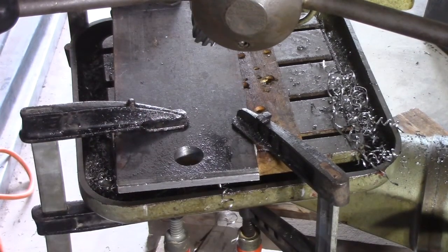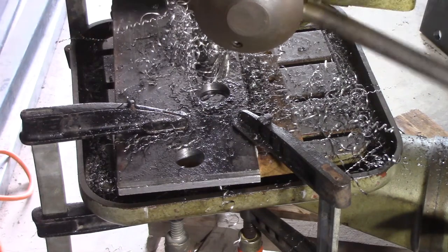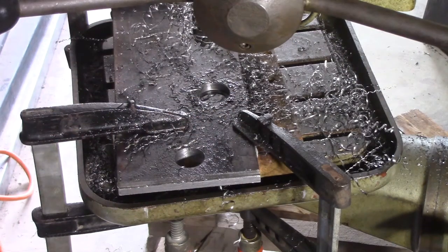This is the first of the 38mm holes and I'm cutting this one at 155 rpm with the 38mm cutter from the US. You can see the bird's nest of shavings collected around the cutter — that's just the difference between the way the blades are cut on the American one as opposed to the Australian one. All the YouTube videos I've seen show this bird's nest. If it is a difference in the way the cutters are shaped, I much prefer the way the Australians have done it because that bird's nest is just a pain to clear off. I think the chip breakage on the Australian version is much nicer.